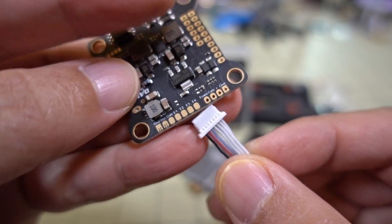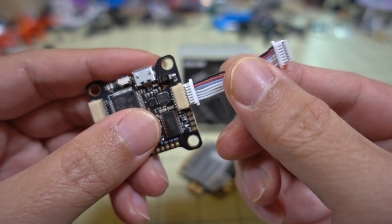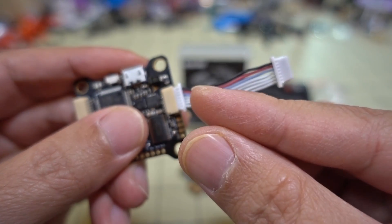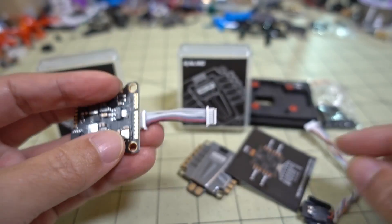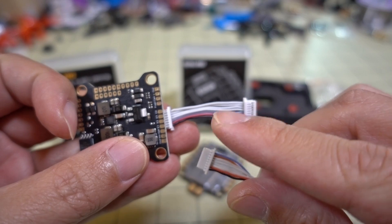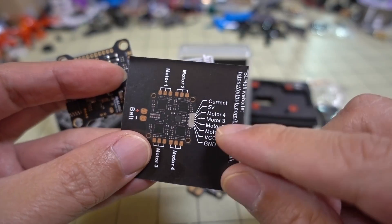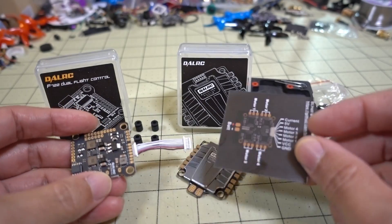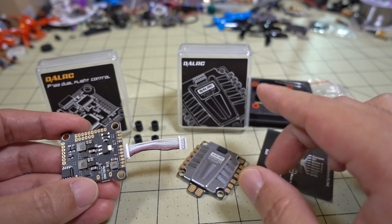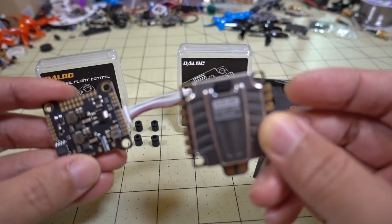The wiring loom order corresponds to one plug on the FC, but as you can see, it doesn't go in that way — it's going to be the other plug on the other side. The connectors are keyed, so the current sensor wire ends up on the other end relative to the ESC connector. If you want to use these two together, some rearrangement of the wires will be needed, and you won't use the 5V out on the ESC. This flight controller is actually meant to be used with the DAL RC Rocket, not the Engine, which I believe has matching outputs.